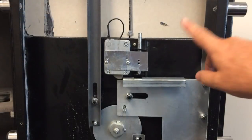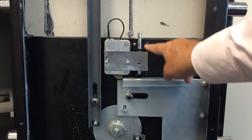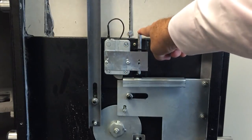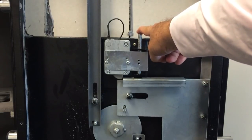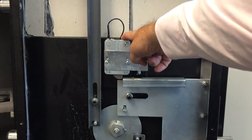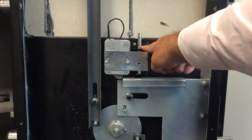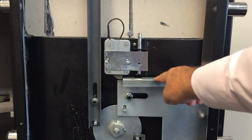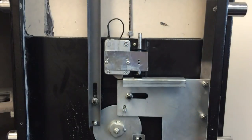The lock is mounted on a mounting plate, and we have a re-locker plate which is holding a re-locker pin in place. The purpose of the re-locker pin is to ensure that the safe is secure even if the lock is punched off through the spindle hole. If this lock were to be punched off, this re-locker plate would disengage with the re-locker pin and the pin would fire into a hole, preventing the bolt work from being operated. We'll ask Christine to remove the re-locker plate and disengage the re-locker pin.